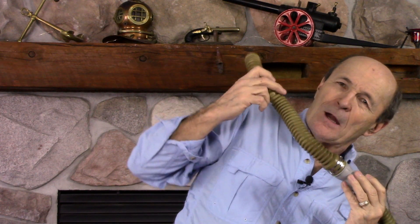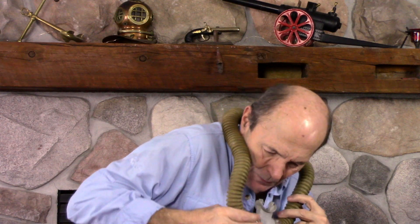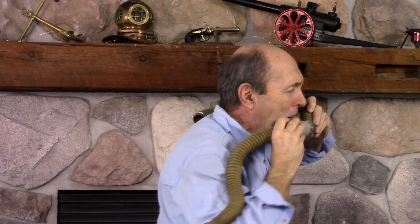With a one-piece hose two-hose regulator, when you started to breathe you had to be sure you were tipped on your left shoulder so air had risen up into the hose. If you needed to clear the hose, you would actually perform a full roll — rolling all the way around so the pressure on the regulator behind you shifted, air flowed through past your mouth and right around — and right at the end of that roll you'd start to breathe. Thank goodness for those one-way valves when they came along.